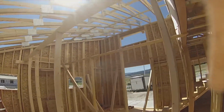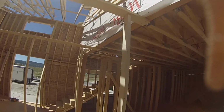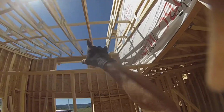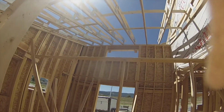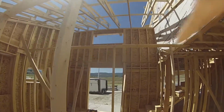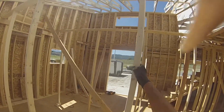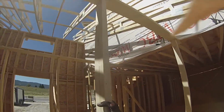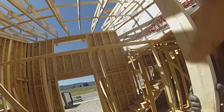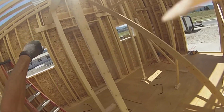Okay, so that went good. Should have probably videoed a little more. The ridge block up there was the key. So the 22.5-inch blocks, that made it really easy. The walkways, when in doubt, add a walkway. It feels better. And then I got the strong backs in, or the bottom cord bracing, whatever you want to call it. So now I'm going to start the overhang fascia piece.